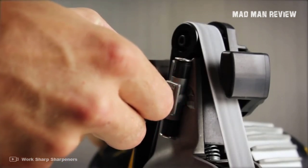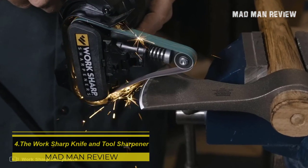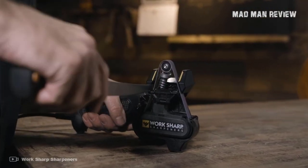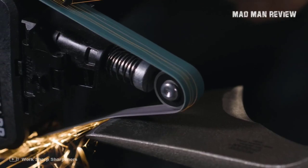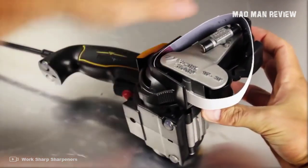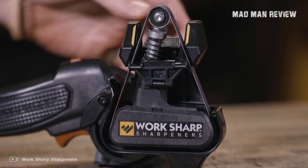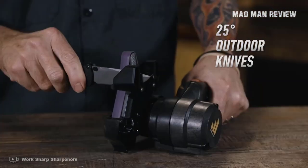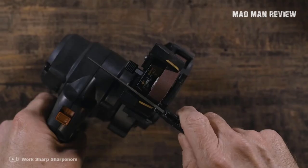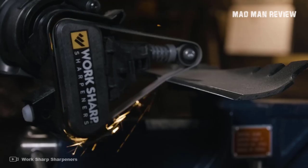The Work Sharp Knife and Tool Sharpener, powered by various belts and an electric motor, is an excellent tool for giving your knives a nice sharp convex edge. It's easy to use and quickly delivers razor-sharp edges consistently, minimizing maintenance time. The belts are very durable and last several sharpening sessions — replacement is dirt cheap. The sharpener comes with angle guides, so just pull your knife through alternating sides of the guides. Be careful with the coarsest belts at high RPM, as you can remove material very rapidly. Also, firmly hold the blade so it doesn't rotate, as this can dull the tip.